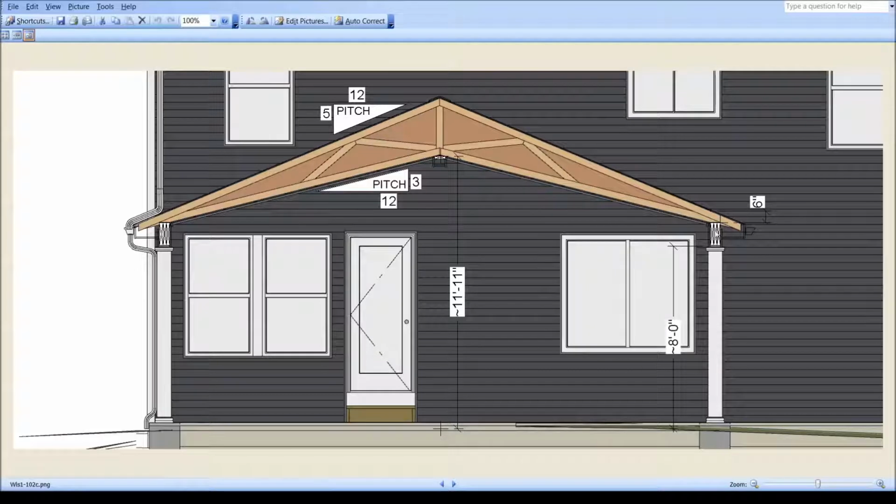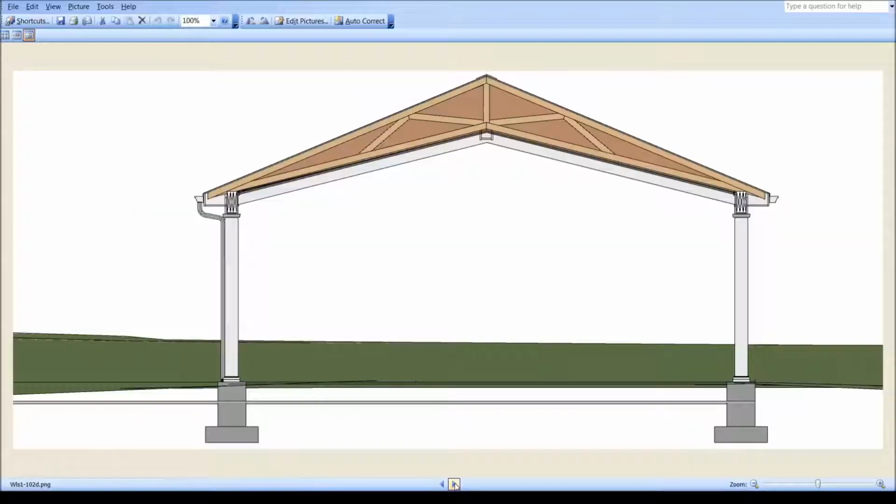These beams can be two 14-inch LVLs or three 11 7/8 LVLs. But if they're going to be 14-inch LVLs, you're going to have to either lower this bearing point here or just look out for the corner of that window there. Looking out this way, this is the beam at the top that carries a fan or whatever.